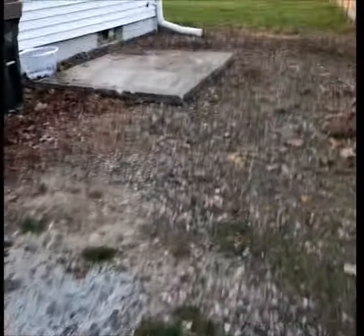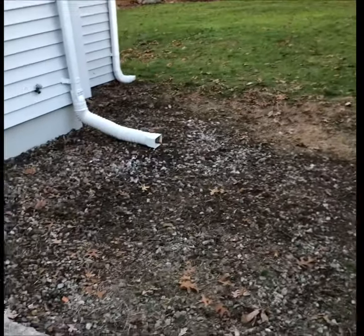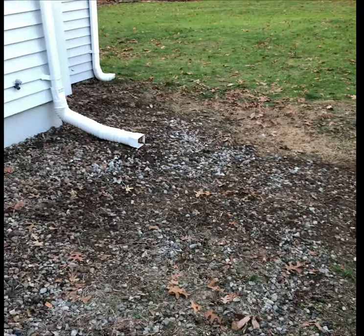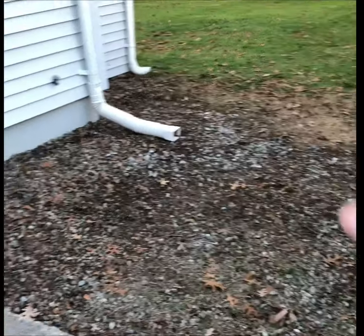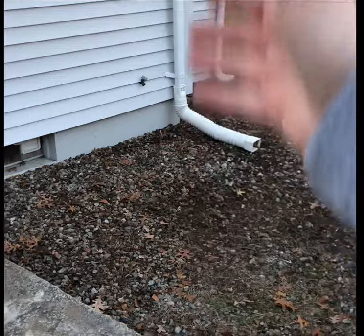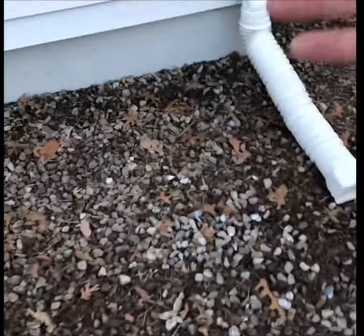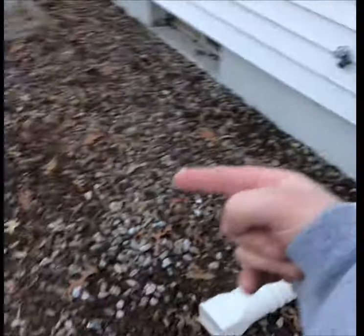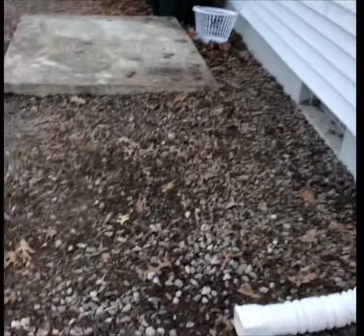Okay, this is the final walk. It's around four o'clock. I made a valley - this is overkill where I had to put in crushed stone all the way. The lean here is overkill. The reason there was even a leak in the first place was a hole - the downspout went straight down for probably 20 to 30 years. Now if somebody leaves that hose on, I've dressed it up. We still need to put a couple bags over here because this would wash away, but it would never go through - it's gonna run away into the valley and go down. Even if there's two feet of snow against the house, it's crushed stone - as it melts it's going to hit that and run out.